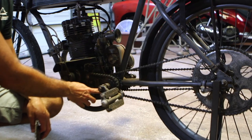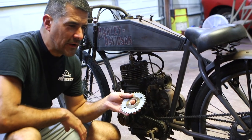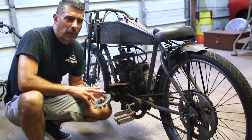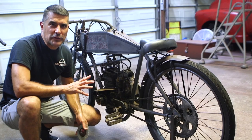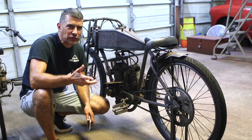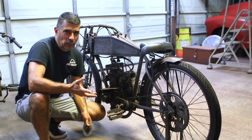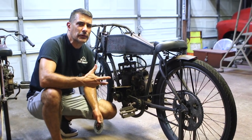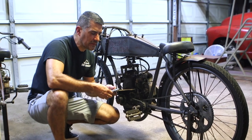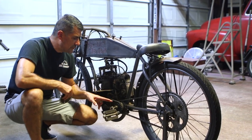The middle sprocket — this one we haven't upgraded yet — I believe it's a 24 tooth, and I'm going to upgrade it to a 29 tooth. There's nothing wrong with this system; by trial and error we found a better way of doing it. If you take a look at the rest of my videos, you'll see one that walks you through the upgraded 29 tooth system. I call it an upgrade because it allows anybody to put this thing together without having to weld parts — you can just buy store-bought parts, assemble it, and you're in business.